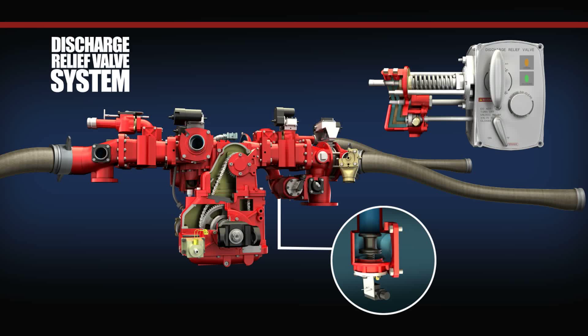The four-way valve handle on-off lever directs water flow based on its operating position. Discharge relief valve systems are equipped with indicating lights the pump operator can use in determining what the current position of the discharge relief valve is in. The amber light indicates the discharge relief valve is open or relieving the excess water. The green light indicates the discharge relief valve is closed, or the discharge pressure is below the pressure the pilot valve assembly is set at, or the pilot valve is turned off.